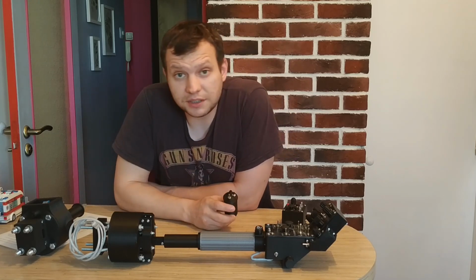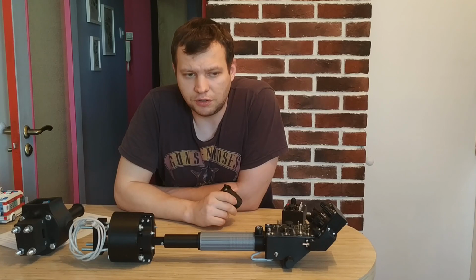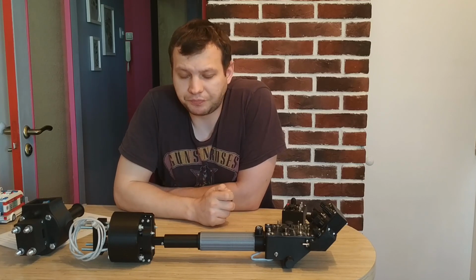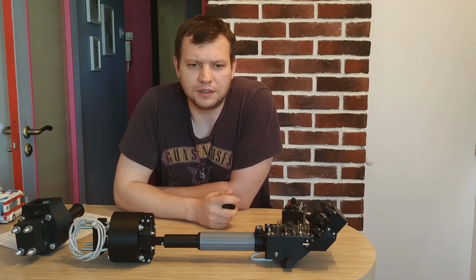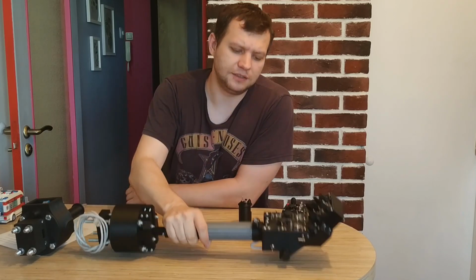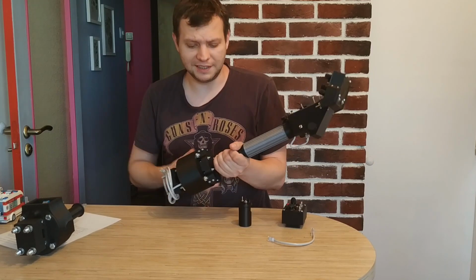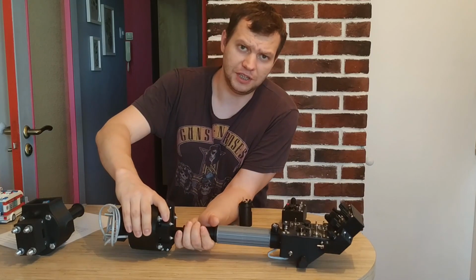So about the bodies of these levers, the first two levers will be something new, because I wanted to make something that was not yet done in Simchair Lite, and that was the motion platform ready stuff. A few guys asked me if I can make motion platform ready hardware for them, and before that I said no, I can't, sorry, it will likely break because of lateral loads. This stuff here actually weighs more than a kilogram. If a motion platform does such vibration and shaking, it will kill this lever over time. I'm quite sure of it.